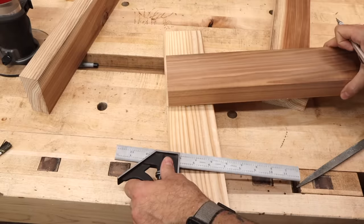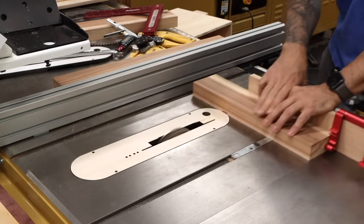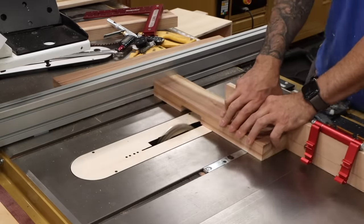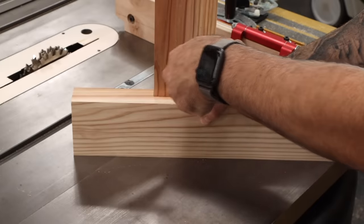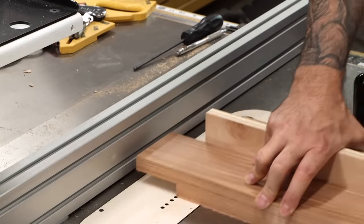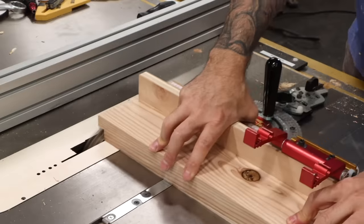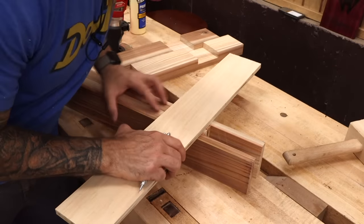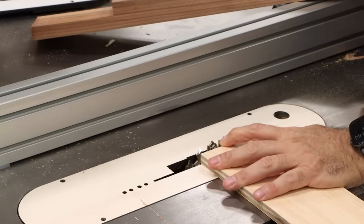If you're making the joinery version, get ready for some half laps. Measure and locate the half lap on the foot. At the table saw, use two stops and a miter gauge to start making the half lap. Adjust the height of the dado stack as you go until it's about halfway through the thickness. I'm usually pretty conservative with my stop locations so that I can widen them slightly until I get the right fit. Now for the complementary half lap in the leg — insert the leg into the half lap we just made and draw a line for the shoulder. Using the fence as a stop, we can start making the cuts. It's a good idea to lower the blade just a little bit so that you can sneak up on the perfect fit. To avoid using support blocks, we're going to make a notch at the top of the legs. The blade height here isn't critical, just go about halfway through the thickness. Finally, we need a notch for the support stretcher. Put your legs together with the half laps facing one another and mark the location of the notch on both legs. Bring the height of the blade to the thickness of your plywood and use the two stops to create the notch.